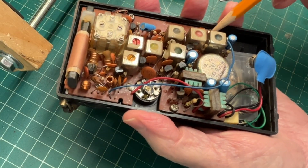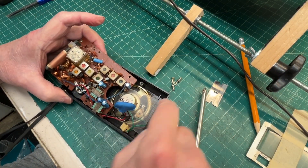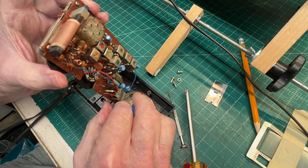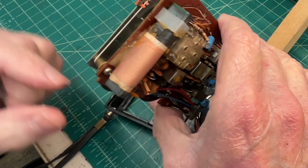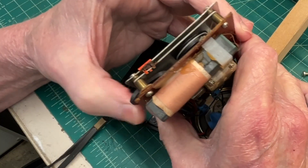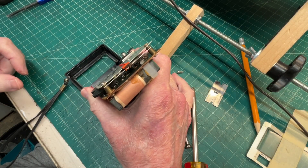Let me remove these fasteners — looks like I've got one, two, three, four, maybe five. Just the three larger screws to get that out, and the nut itself for the audio jack. And there is a dial cord, just what I expected since the frequency changer was over on this side. So it's not broke — it was just seized up or something. Let's power this back up and see what it does.